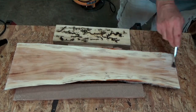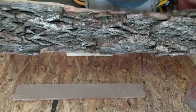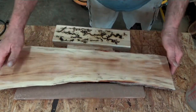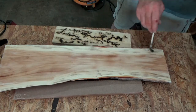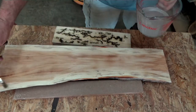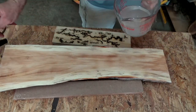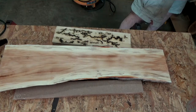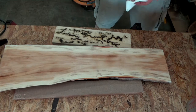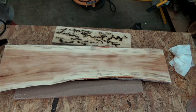What I am doing right now is soaking the willow — this is the top piece, the bottom part is bark — just trying to get a good flat top on the trunk. I am putting a solution of water and baking soda: one cup of water, one tablespoon of baking soda. It helps the electricity pass a lot easier. You don't want to have it sopping wet. So let me grab my fun stuff and we will get to doing some burning.